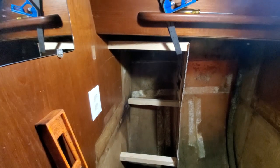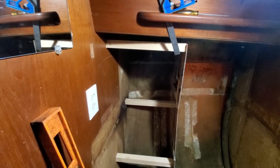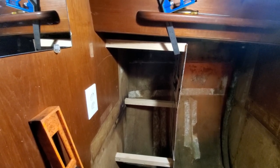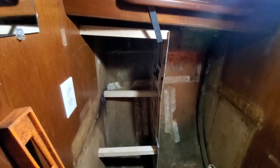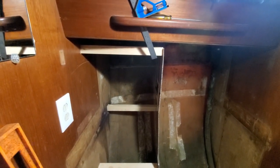And so this cabinet will stick out a total of 16 5/8 inches from the wall. With that 18mm plywood, I just had to cut that to 15 31/32, and that should wind up pretty much within a 16th of 16 5/8. And so we'll get this all put together here, but really happy to see this.